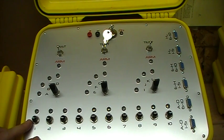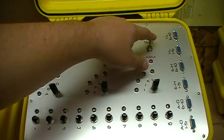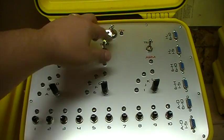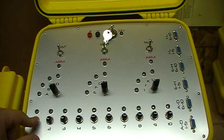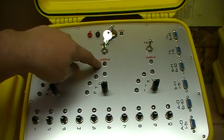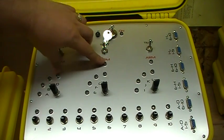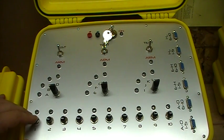Something I like about the continuity testing is you can test three cues at once. The testing mode works basically the same as arm mode — you can flip all three stations to test mode. If you have all three on A1, E1, I1 and you push number one, it does a continuity test on all three simultaneously. If A1 and E1 are good but I1 is bad, those two lights come on and the third doesn't — so instantly you know to go check that cue.